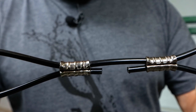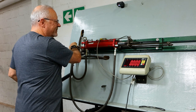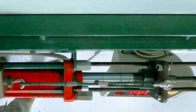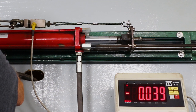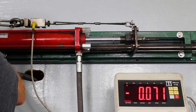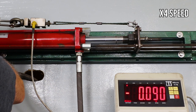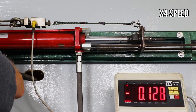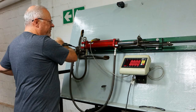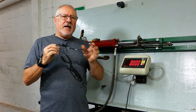We've done this on our 2mm mono crimps and it increased the holding capacity quite substantially, so in theory we should have a higher break strain. Let's hope so — the other one went around 120-ish. No slippage yet — and we're up to 130 plus. That's very good, so my modified crimp design definitely has better internal grip ability.